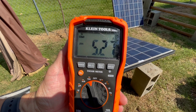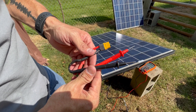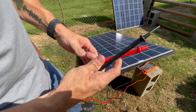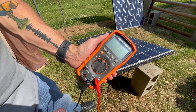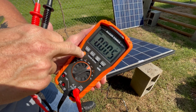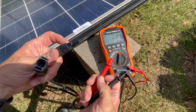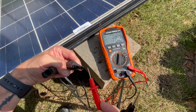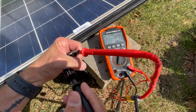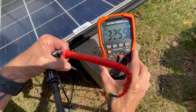I'm going to show you this test again, except I'm going to show you how to do it with the regular probes. These are my probes with the XT60 connector — let's go ahead and plug this in. Again, you want to start with the multimeter off. Turn it to voltage, set it to DC volts. Testing with the probes: positive to positive, you just put it right down in the center. Same for negative — you want to make good contact. You can see we're bringing in 32.55 volts this time.